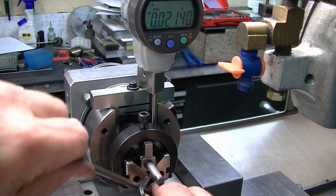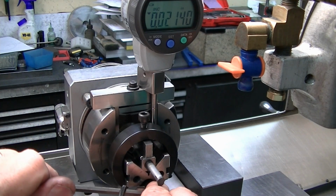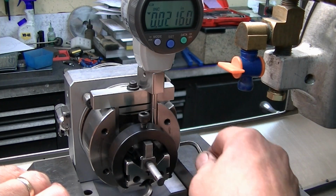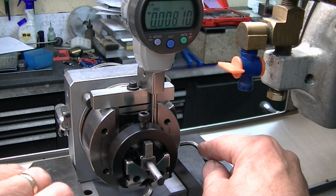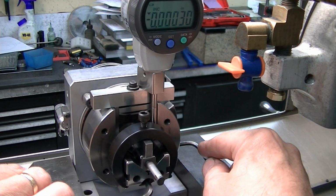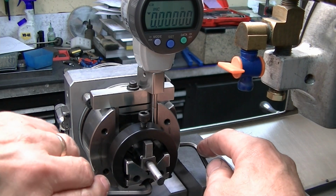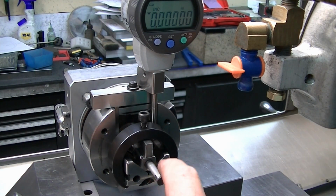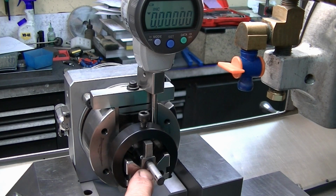So we're going to loosen our bolt that holds our V-block, snug, find our drive here and drive up to 0, in the ballpark of 0. Okay, 0. And now that this is running true, the main shaft's running true, and we don't really need to be offset for any of the other operations, but this won't give us any problems of being off center, not anticipating that.